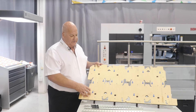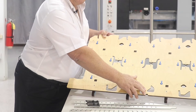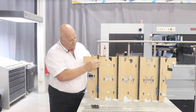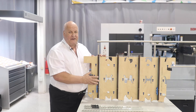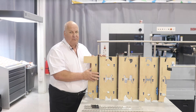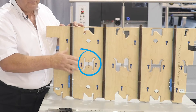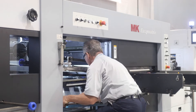Looking at the tool in more detail, you will see a couple of key things to note. Here you will see the centerline notch, which ensures correct alignment of the tool in the machine so that it will be perfectly aligned with the cutting die. On the underside you will see the quick lock bars — these are the bars that secure the central stripping board in the machine. These are typically made by the die maker in wood to reduce costs, however it is also possible to use metal bars for more rigidity and sometimes a simpler application when the waste stripping holes may be rather large.